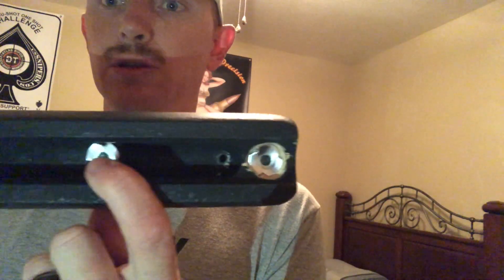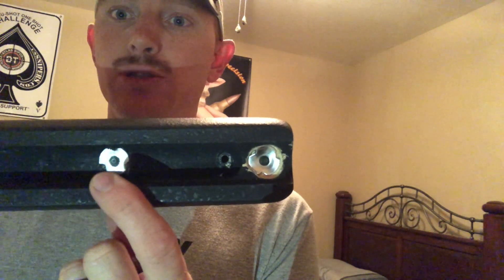For the front one, that wasn't going to work because I needed to have the barrel clear this channel. So I took a three-quarter inch spade bit and just drilled down in there nice and slow to make sure I had a recess for that to sit in there. Then ran a new screw up through the bottom of that — fit in there perfectly and just mounted it to there. Made sure that I did have to drill a new hole if you can see in there. This is an original hole from the Boyd's tactical stock. This is the other original hole — I had to drill and then bore out that hole. I used that spade bit to do that. It was a nice slow process — I did throw it in my drill press, but I didn't have the sharpest bit to do this, so it kind of looks like crap. But it's underneath the barrel — nobody's going to see it.